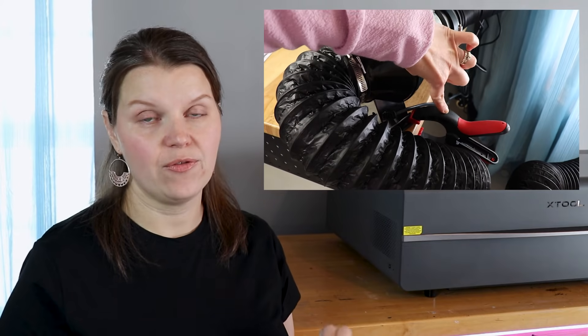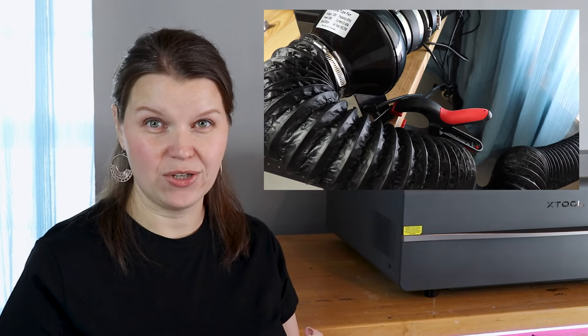Option two is a variation on venting out a window — it includes adding an inline fan to your hose. I have a full video walking through the inline fan setup on my Xtool S1, so take a look at that for exact details. Here's why you might want one: if you're cutting materials that produce a lot of smoke, like wood, or materials like leather and acrylic that give off an irritating smell, and the fan inside your laser venting out the window just isn't enough, you may want to add an inline fan. The inline fan hooks up to the hose of your laser, with another hose out the back going out the window. You can turn off the laser's internal fan and rely on the inline fan, or have them work together.